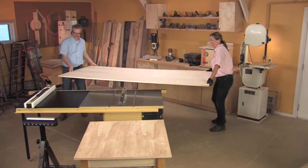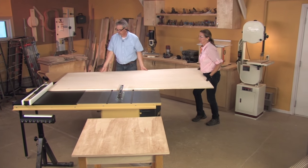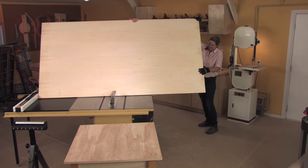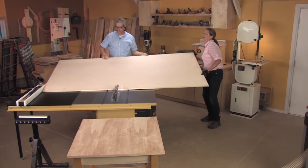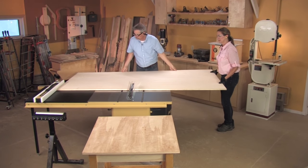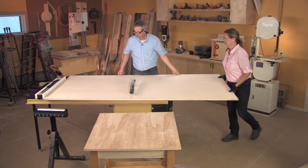The operator or cutter's job is to guide and feed the cut. Once it's on the table, you want to lift the piece vertically to power up the saw, then butt the sheet against the fence and keep it there. The partner's job is to walk along with the pace of the cut and keep the piece level so it won't bind.